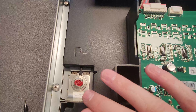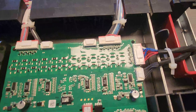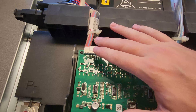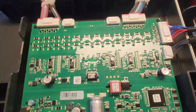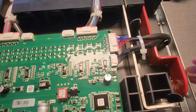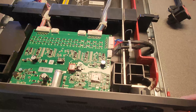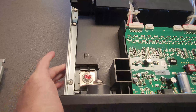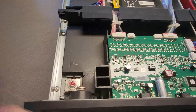This is where we're going to connect the BMS — keep an eye on that ground bar. I believe these are our lead wires that go to the batteries. There's eight here, eight here, and eight right here. It's my belief that these all go to the battery, so I'll be figuring out how to validate that. I don't want to rewire things or take all this plastic off — I just want to use this basically as is. I've confirmed the body is not grounded to the ground; they're isolated, so that helps with some protection.